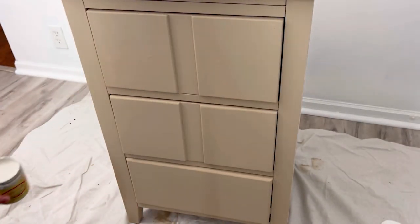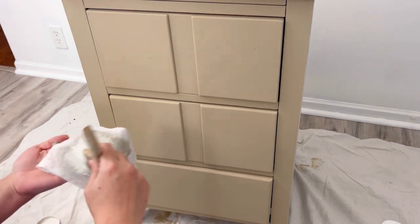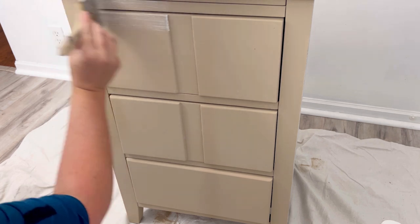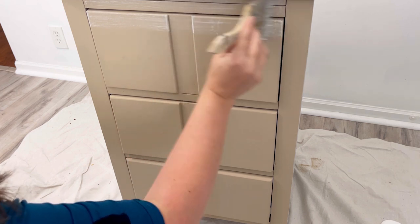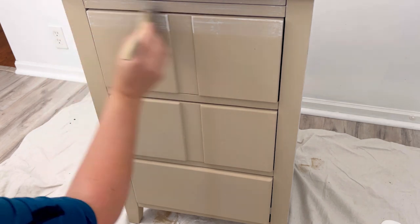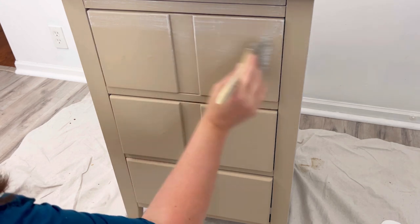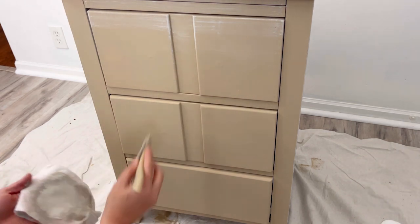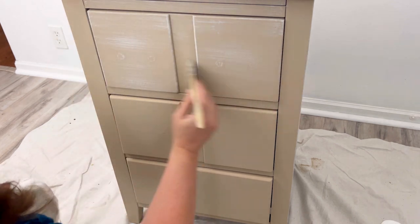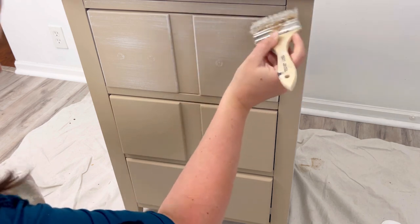Two coats of Burlap are all dried, so now I want to start applying Sawmill Gravy using a dry brushing technique. I use a chip brush and a rag and apply some paint onto my brush, then wipe a lot of the paint off because we don't want full coverage — we're just feathering the brush with a really light hand back and forth across the surface. I follow the pattern on the piece: drawers go horizontal, sides go vertical. I use a medium color as my base, then a light color as my first coat of dry brushing, then a really dark color to add depth, then go back with the light color — three colors in all.